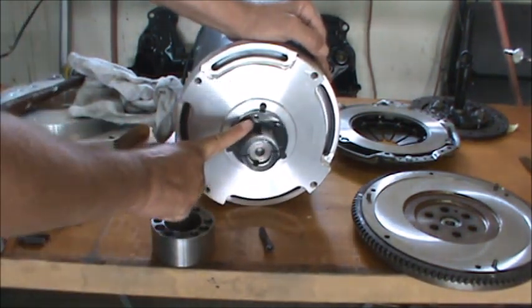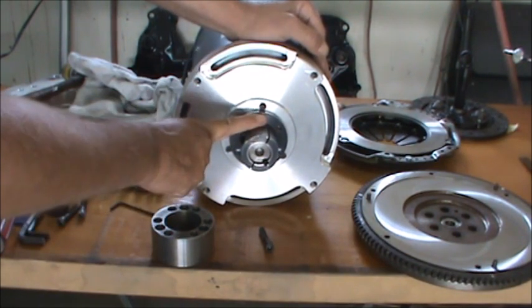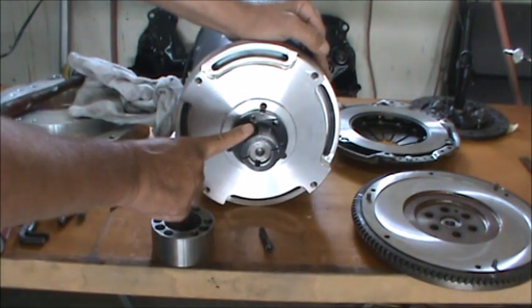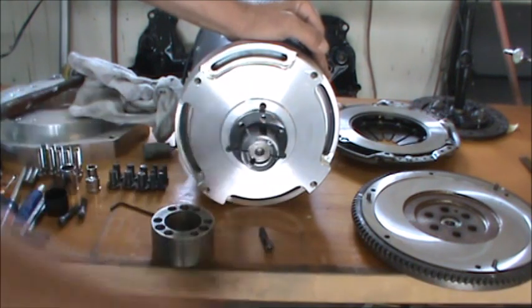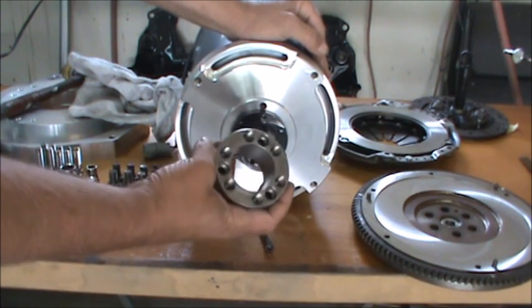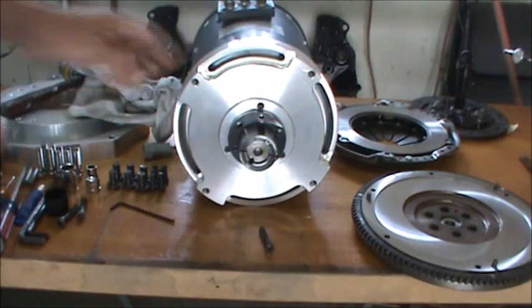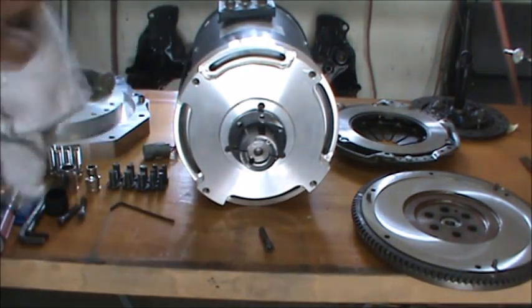Of the ones I've seen, motors with more power online with the same type of coupling, and they didn't have a key. So that would have been a bit of a bear to put that keyway in there. It could be done, but everything is on the taper, so we're going to go ahead and do it without a key. I don't think it's going to be an issue.